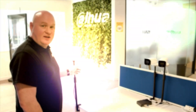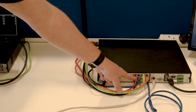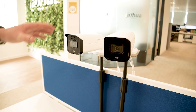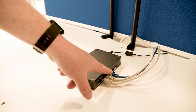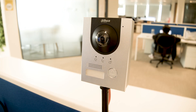I've connected the access point on the red network cable — you can see that same cable on the network video recorder. In Bridge Mode, I have an eight-channel network video recorder, but I also now have a nine-port PoE switch. I have two 5 Series active deterrent cameras plugged into a four-port switch — you can see the blue cable here connecting that switch to the network video recorder.